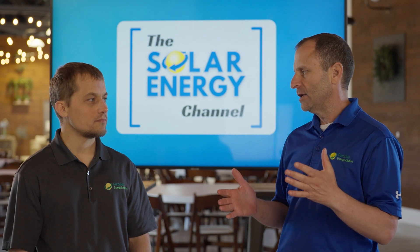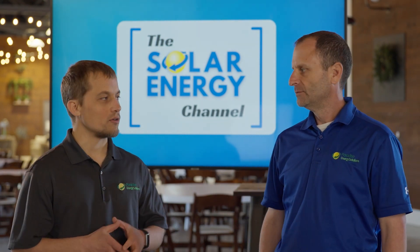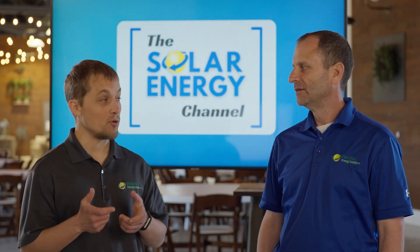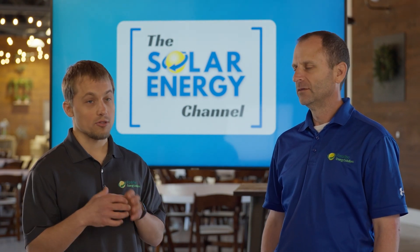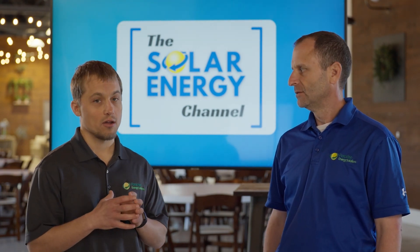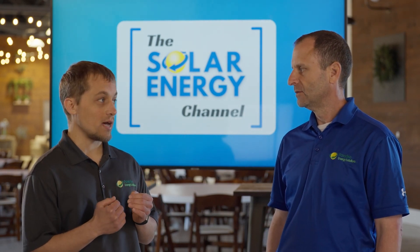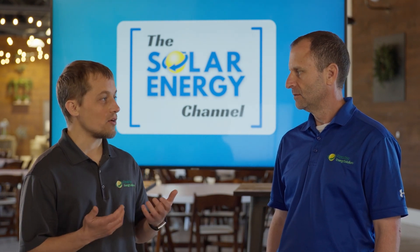So Larry, what is load management and how does it work? Load management is important when you're considering using batteries, because one of the things you don't want to do is when you fire up your battery system, have more loads than your battery can handle, or have loads stay on longer and the batteries start shutting off. Load control allows you to shed some of those loads when the power goes down so that you can use your batteries longer and your system runs better and more efficiently.